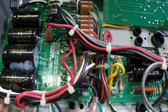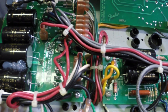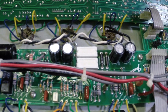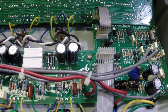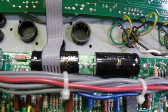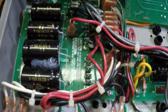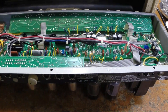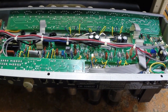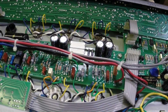A lot of people think filter caps mainly cause humming problems, but they'll cause all kinds of oscillations, whistles, and weird stuff. There was probably less than a half hour of troubleshooting in this amp altogether — the rest of it was spent actually executing the repair. There's a lot of PC board stuff to deal with, but we got it taken care of. Just thought I'd show you before I buttoned it back up — just another case of cheaper import capacitors failing. This is roughly a 2005 amplifier, so I'm actually surprised he got this far with it.